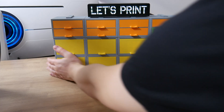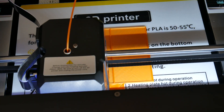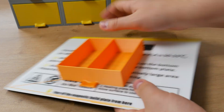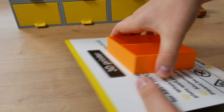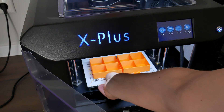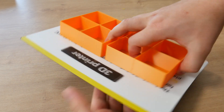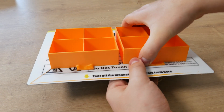In one of my previous videos I built a storage box, and all those orange drawers were printed with this printer. They turned out absolutely nice quality, but not all survived the process of removing them from the print surface — trying to remove those drawers I just broke them. To fix this I use a glue stick. Between the part and print surface there is one thin layer of glue, so the PLA won't print directly on the surface but on the glue. The glue does not stick so well on the surface, making it possible to remove parts in one piece.